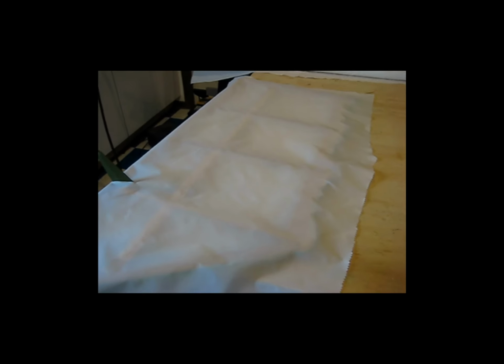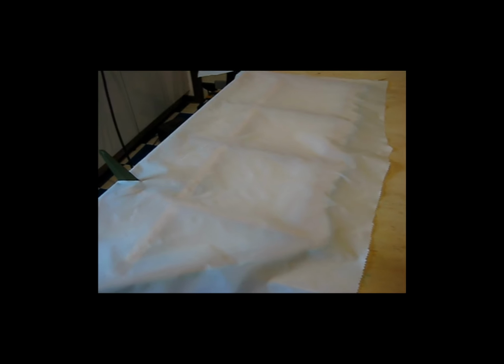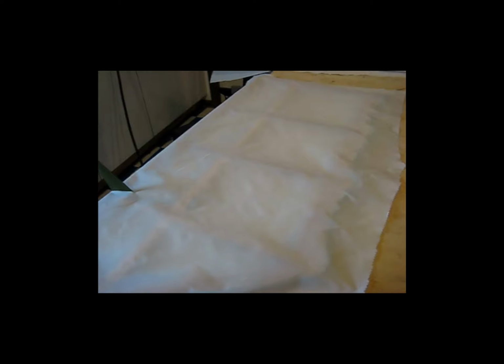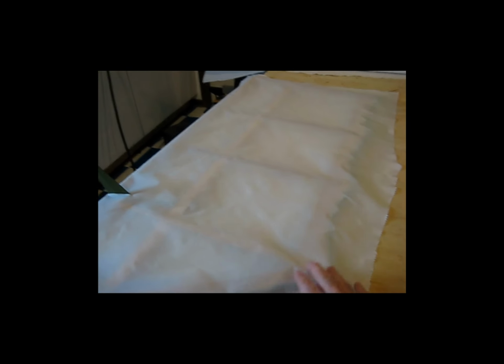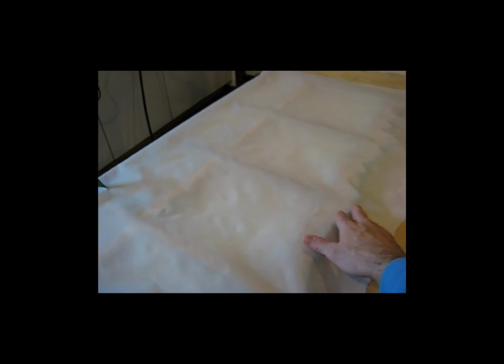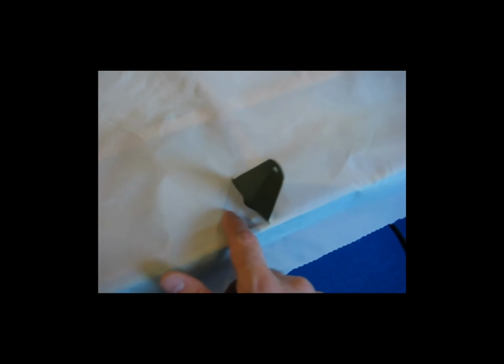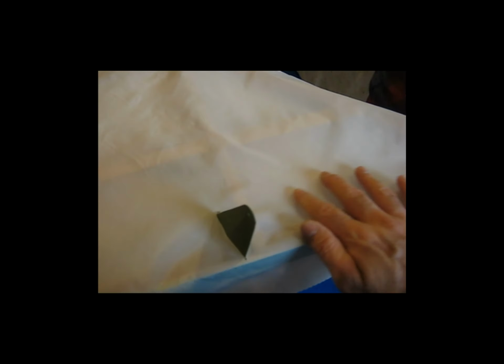On these pieces that have the scalloped trailing edges, I usually like to work the scalloped edge first. Since the fabric is loose everywhere, it's able to move around and kind of take a set around these scallops that suits it best as I work it with the iron. So I try to leave everything else loose. However, when doing that, I don't want to pull the fabric away from this horn in such a way that it's going to leave a larger than necessary gap around it when I shrink it.